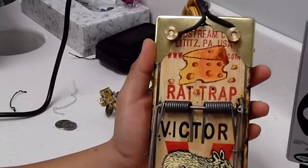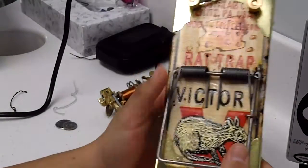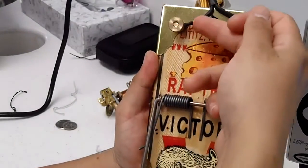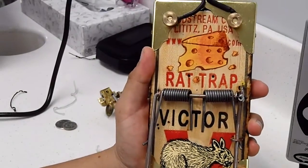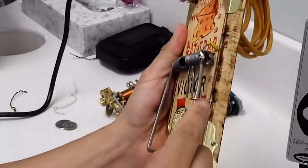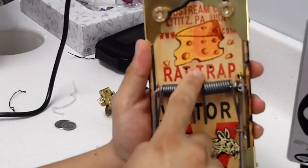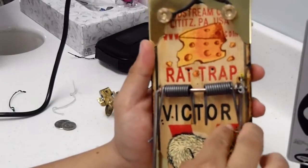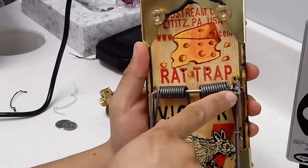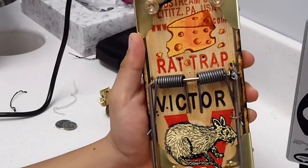Later on I'll show you how this thing runs. It runs out pretty cool, it has some nice contact — you can press on it. When you buy these rat traps, the spring is all the way back and has a lot of tension, so you've got to make sure. It has some other connections right here and a U-clip right here. I use the same U-clip that was holding something on the trap, and I pass it to hold this part. One of the wires coming from here exits through a hole right here, and I solder it so it has a nice contact. The other wire goes from here all the way over, and when you press on it, it makes the contact — that's what makes the machine run.